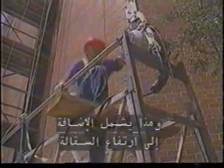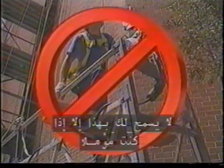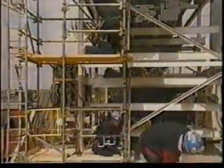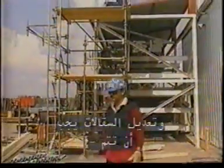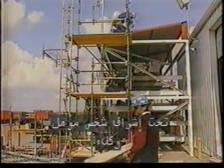The specific requirements for designing scaffolds are more complex. They include size and spacing requirements for vertical, horizontal, and diagonal members depending on the scaffold height and weight to be supported. The bottom line is clear: don't design a scaffold unless you are qualified to do so. This includes adding to the scaffold's working height — you are not permitted to do so unless you are qualified. Erecting, moving, dismantling, or altering scaffolds must also be done under the direction of a qualified competent person.